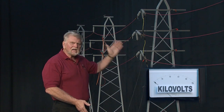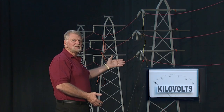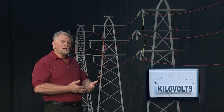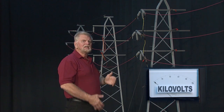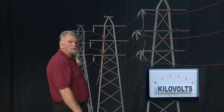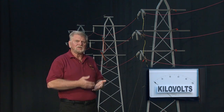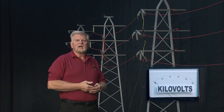Some employers have requirements that go even further. They require a second set of three-phase short-circuiting grounds to be installed on the opposite side of the structure so that the worker is always working between grounds. I will now install the second set of grounds on the opposite side of the structure, placing the grounds on each side of the worker so that it does not matter which side the accidental energization comes from. By doing this, the worker will always have protective grounds placed between them and any source of energization, regardless of the direction it comes from.